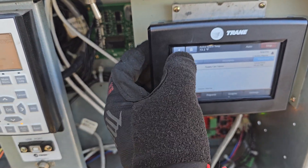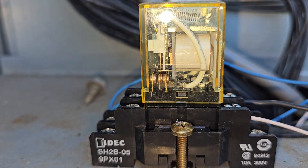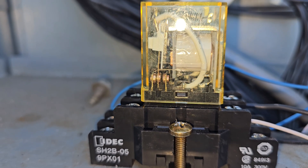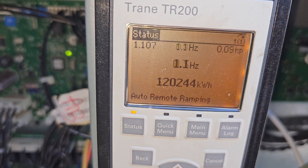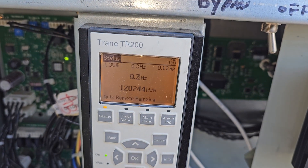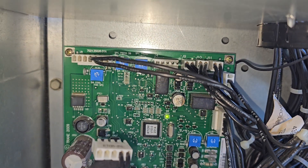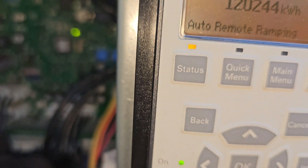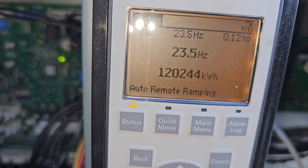I'm going to reset this right here. When you reset it, the relay should move. There it goes — it's starting up again because now the drive is enabled. I'm going to do it one more time for demonstration — I'll pull the discharge sensor again, the drive is going up, watch that relay get activated, and the drive goes back down. You get the idea.